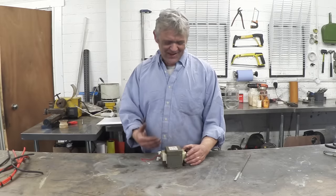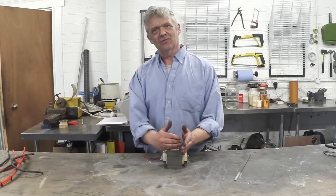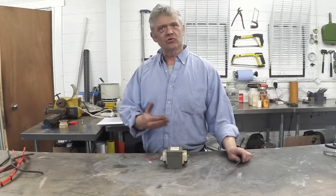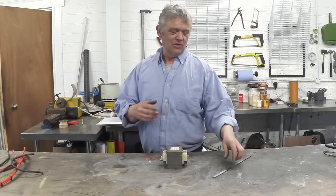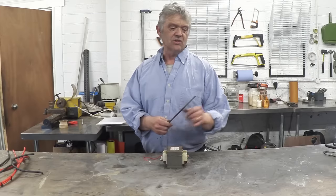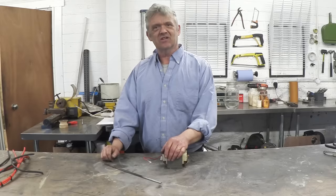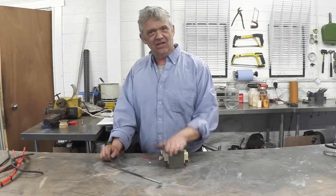That was really hard work, but in the end what I came up with was cutting both of these sides off, drilling it out with a drill bit somewhere about 8 to 10mm, and then instead of using a bolt or a chisel — which basically spreads those wires and locks everything in place — what I've been using is a strip of steel, 3mm thick, 1cm across, flat ended. That works really well. It takes about five minutes to get those out. It's astonishing. Anyway, we're just going to demonstrate that and take that out.